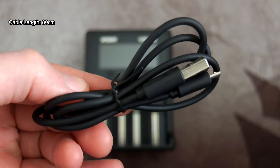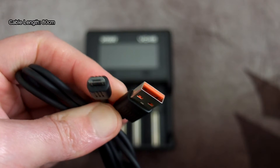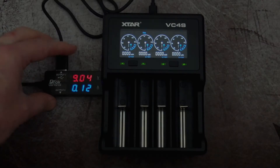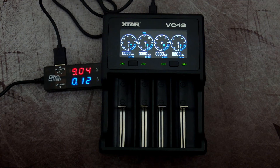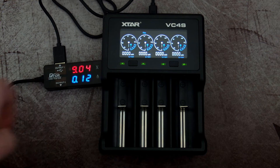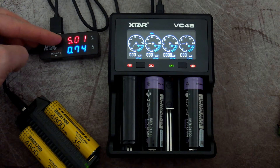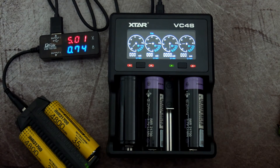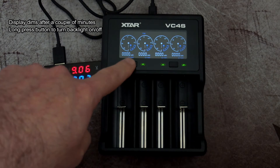The supplied cable is 80 centimeters in length with a red plug. Not all micro USB cables support Quick Charge. Powering up the charger now with it connected to Quick Charge — you'll see the 9 volts come up. A normal USB connection gives you 5 volts. That extra voltage from Quick Charge is how we get the additional charging speed, similar to how faster charging works with a phone.